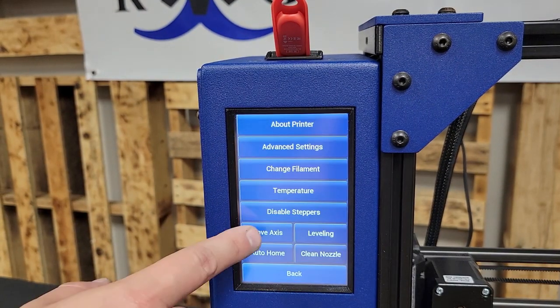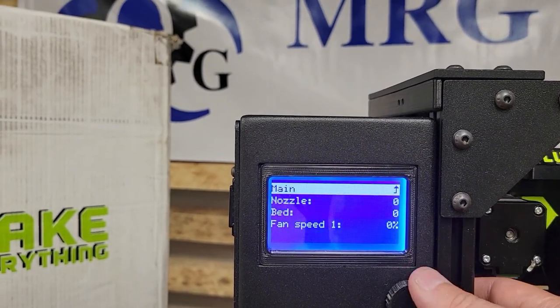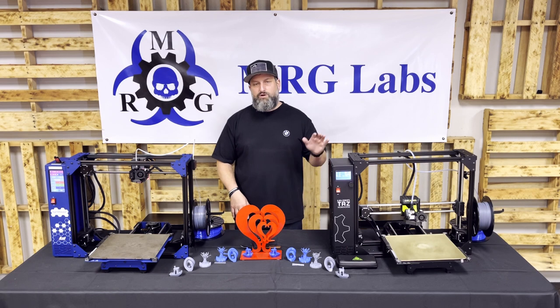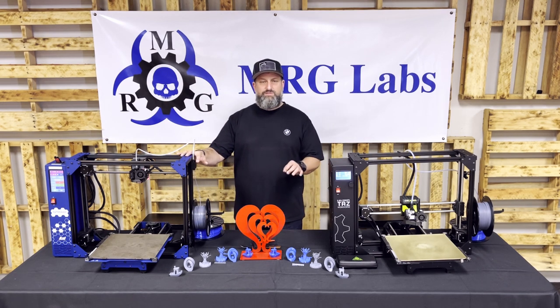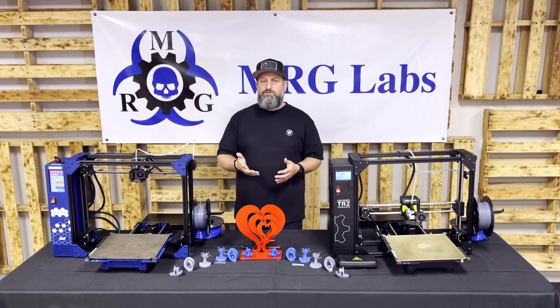With respect to the screens, I found that the touch screen was much easier to use and select the files I want to print. Once a print is started, each printer will auto-home and then set and wait for the temperatures to be reached and the final wiping of the nozzle. However, the Workhorse forces the four-corner leveling prior to each print. I found this annoying because every time I wanted to just start a print or restart a print job, I have to wait for it to go through the sequence. With the Axie, you already have the mesh bed level compensation stored and it will use that automatically. You may want to do an X-axis level, but you would only need to do that after turning the printer on and off, not for every print necessarily.